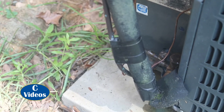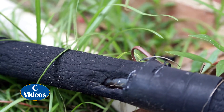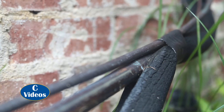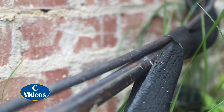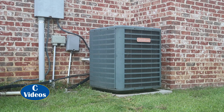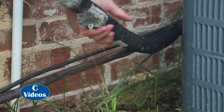The insulation helps keep the line cool when the low pressure freon is returned to the compressor and condenser, and every degree helps with the efficiency of the units, especially in the summer. As you can see, the insulation on my units was in pretty bad shape. If you see here, the two lines are touching each other — through the routine vibration of the lines this can actually rub a hole in the line, and the freon would then escape out causing a whole host of other issues. Believe it or not, the control wire rubbing against the pipe over time can also cause a hole.